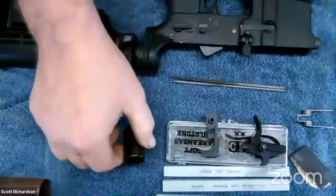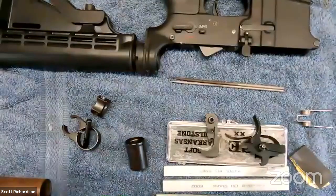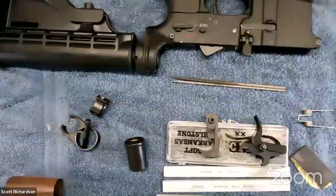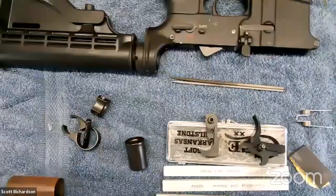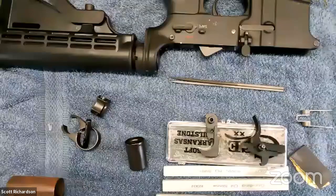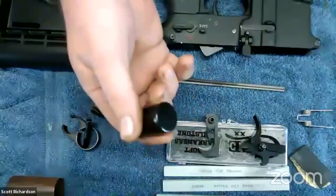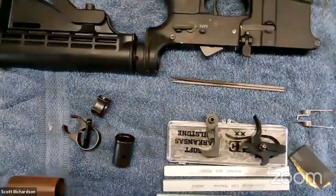You apply it carefully with a cotton swab, just a quick pass covering the whole thing, and let it set for 24 hours. Here in Oregon the humidity is great for this — things naturally just rust. You want that fine orange velvety rust all over, then throw it in a pot and boil it for about 15 minutes. It turns the rust black, then you go at it with a carding wheel or super-fine steel wool and polish that black rust off.